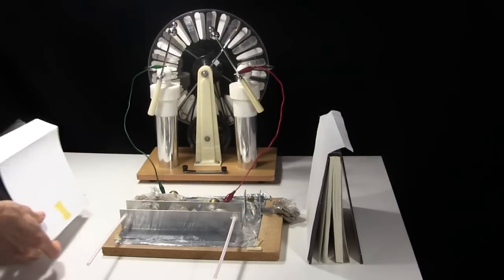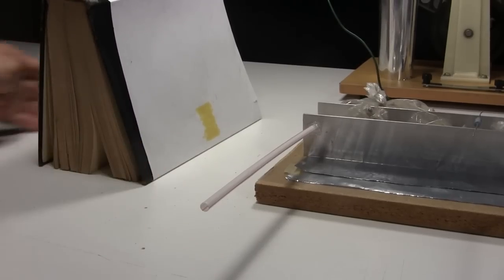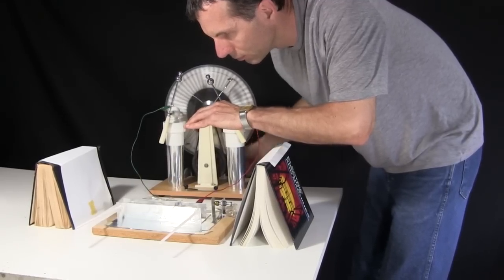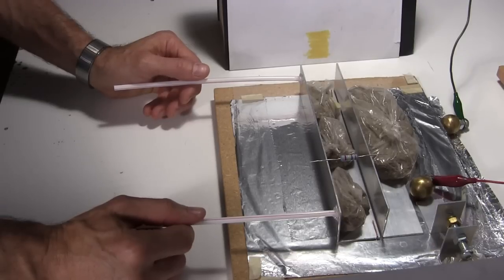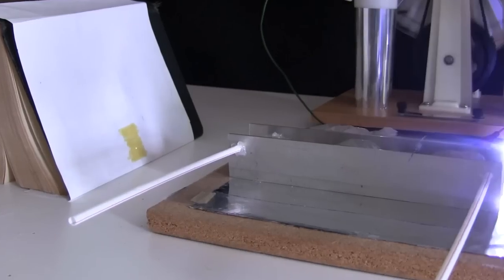Then come some targets for the laser so we can see it. The laser beam fluoresces green when it strikes yellow highlighter ink. Adjusting it takes a while since the spark happens only once every 12 seconds or so. When the spark occurs, ionization and sparking also happens in the lasing channel — that needs to be adjusted just right to get the lasing to happen. But after three or four minutes of adjustment it starts working.